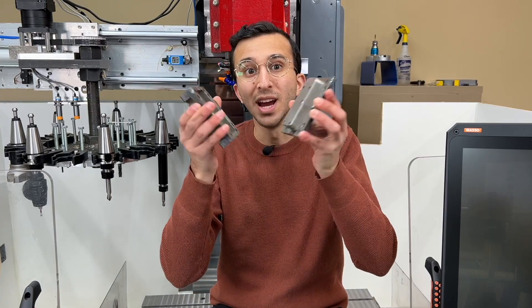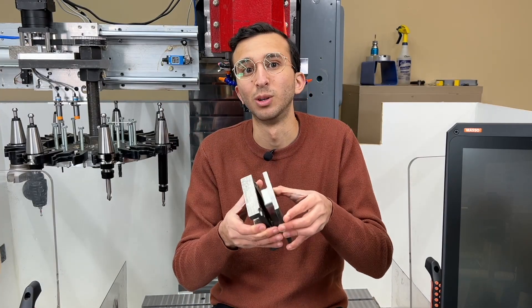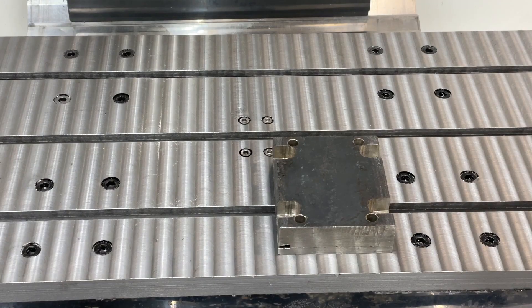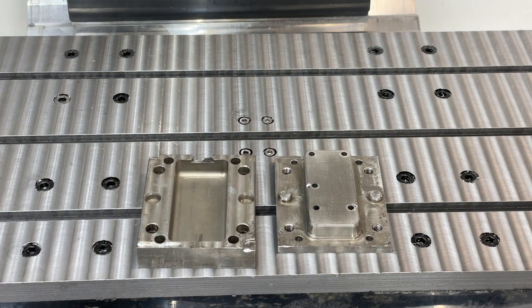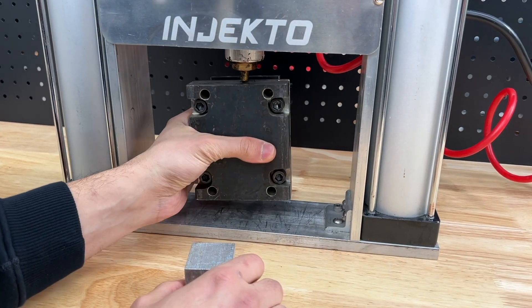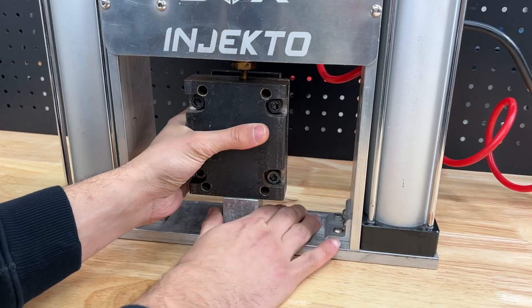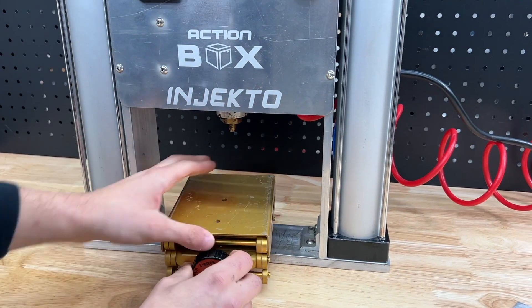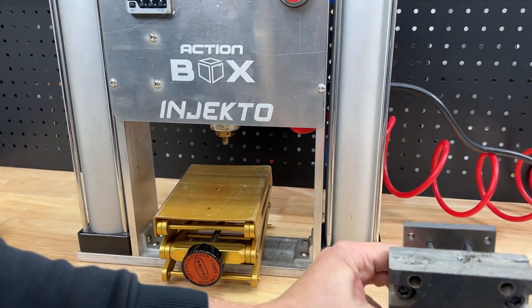To test this machine, we made molds using our DIY CNC machine which you can check out in the description below. This mold used in our fully automated DIY plastic injection machine made us hundreds of parts before it was retired. To inject, we simply elevate the mold opening into the injection nozzle which is spring-loaded and press the injection button. That's it! You can also use a scissor lift here if your mold is small enough, but our mold was very tall.